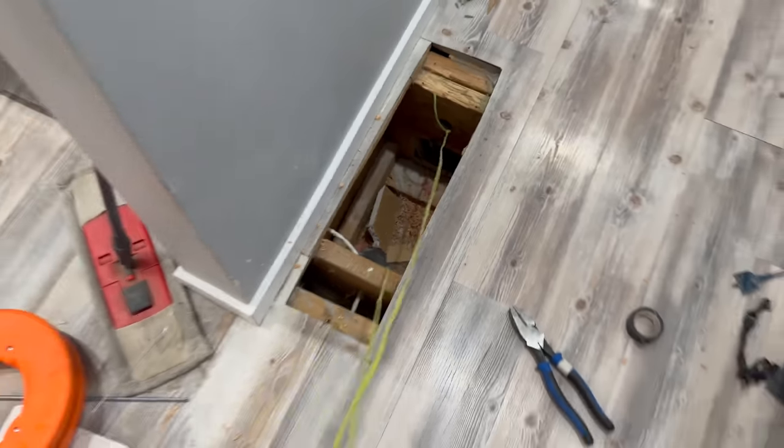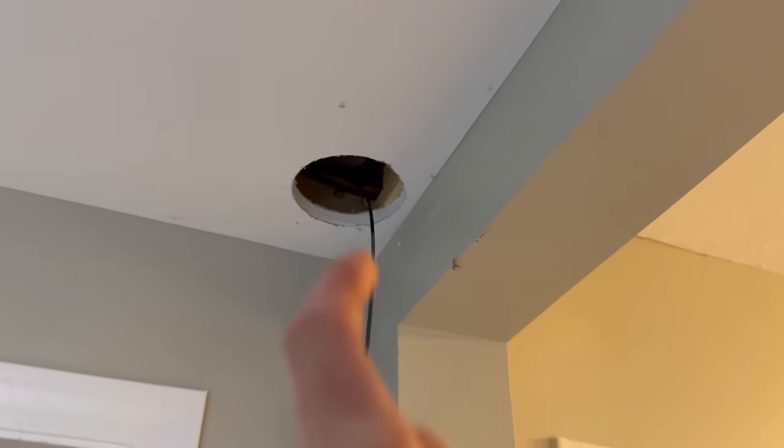All right, so before we get into the video and look at what is the scope of work to do, let's see what I did the previous night. This was many hours spent of fishing in this challenging spot to try and connect the downstairs hallway that was renovated, which was not even originally part of the house. It was an open carport, so we had to drill one hole one way with the extra long drill bit to get the fish tape you see we're pulling out, and then snag it with this other fish tape ran 90 degrees to the other one that we were trying to pull out using this air return duct as a way to get into there. So you can see the tape that we pushed into there, and that is the one that we hooked and pulled through on the other side, where we can then connect pull string through.